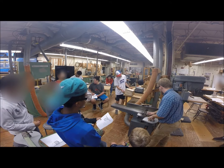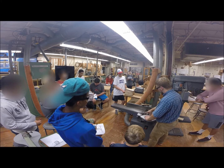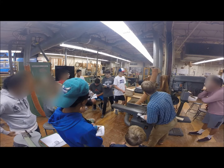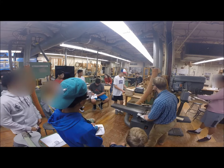This is just similar to a planer. The only difference is, if you can see inside here, we have what's called a helical blade system. What that means is the blades are wrapped around the circumference of the cutter head helically. Basically, if I were to grab the straight blades of a planer and twist it, that's called a helical twist. So this is called a helical cutter head.